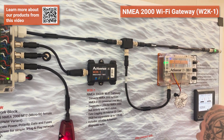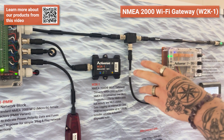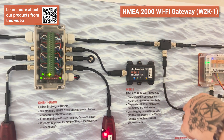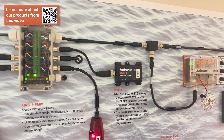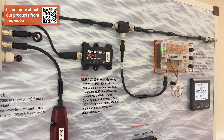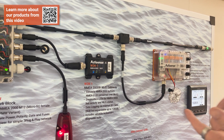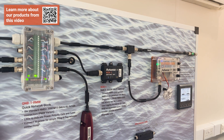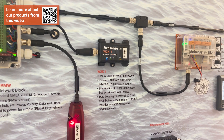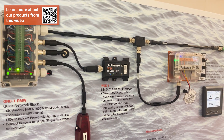Coming across to the other side of the board, we have the W2K, which is our wireless NMEA 2000 gateway. It's connected to the QMB, as are all the other devices, all connected to the NMEA 2000 backbone. The W2K in one form is a data logger — it has an internal SD card that logs every single bit of data that goes through your N2K network. As standard it has an 8GB SD card, but it is expandable up to 128GB for those with very busy networks or who want to log for longer periods.